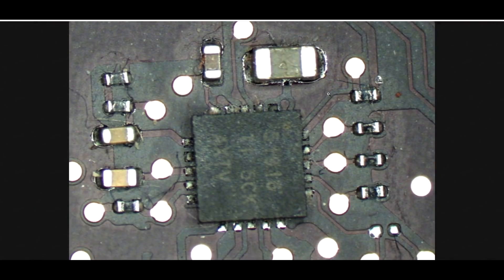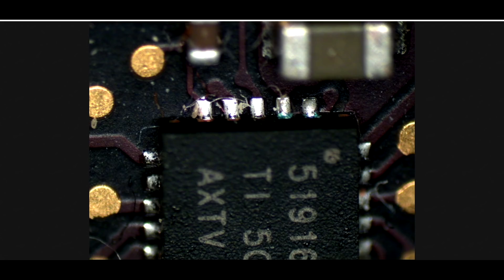Hopefully this is helpful for anybody who's curious why I do that in my videos, and maybe it's changed the way you work on things. Maybe you'll find more fixable boards by using this strategy. One of the things that is incredibly important in this business is the findings you get from corrosion. If you look at a chip and see green on the side, and the problem is the machine jumping between 24 and 54 milliamps — the next time you have that issue, even if there's no green on that chip, you remember the last time it happened it was green on that chip, so maybe that's the problem this time. You replace the chip and it works. This is how you build a database for yourself as to what's going on with each individual machine and create these troubleshooting guides in your head. Corrosion is an excellent teacher — better than anybody I had in college.